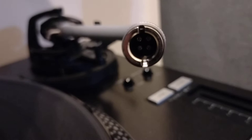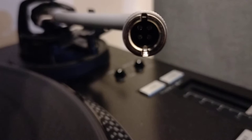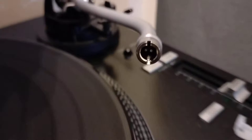One last little thing to do: on your cartridge itself, just before you put everything back together — have a look at the four little pins in there. With the power off, make sure those are all springing back. Just get a very very small flathead screwdriver and push each one of those in and out.